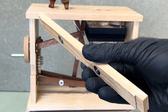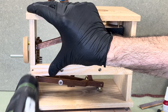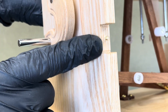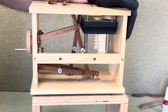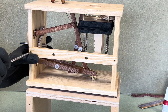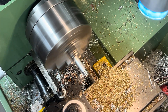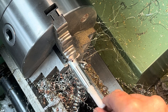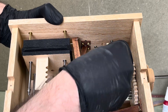Next I'm fixing one of the two timber supports into the side of the box using brass screws. These supports hold the two main shafts, each with bearings. I managed to snap the head off one screw — luckily the broken piece was protruding and easy to remove. Unfortunately I didn't learn my lesson; I snapped a second screw and this time it was buried. I had to gouge it out, fill the hole, and then drill larger pilot holes to avoid a repeat. I also remembered I'd forgotten to add a Teflon bush earlier, fitted into a machined brass tube. This bush is fixed to the underside of the main box using two-part epoxy resin.